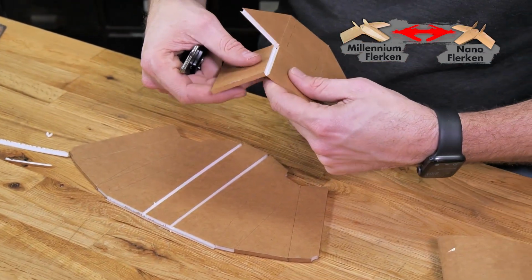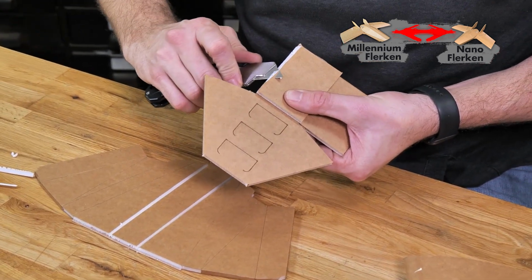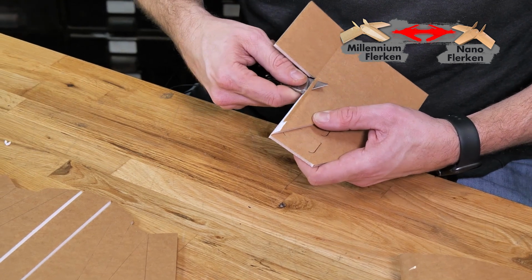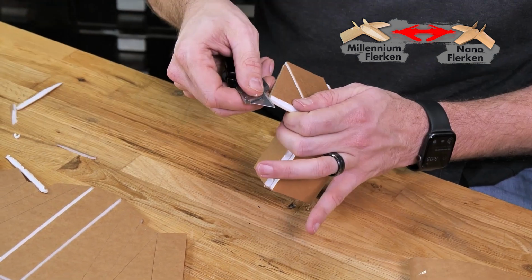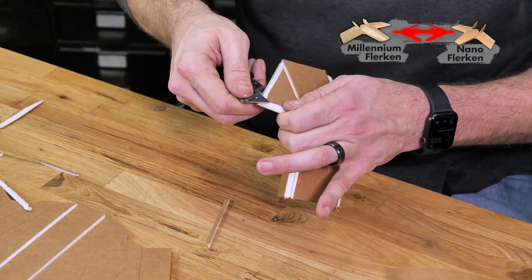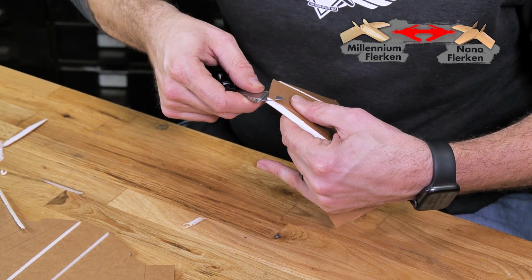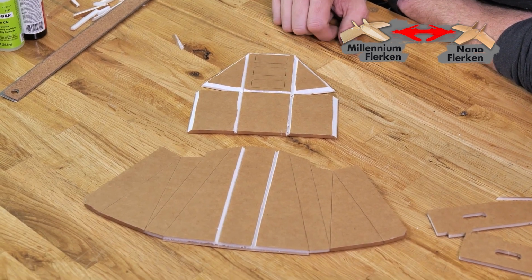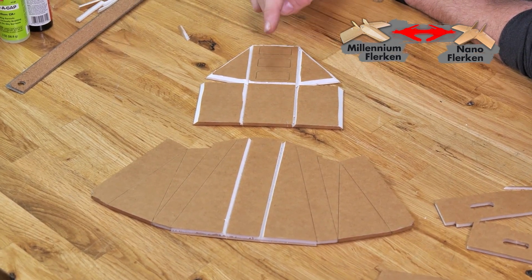And we'll do our single bevel cuts on our rear piece. And we'll continue these single bevel cuts all the way around this back perimeter. Now that we have all of our single bevels cut, feel free to pause your video and make sure that your pieces look just like what you see here. You're gonna see that the single bevels on the front nose favor towards the outside. And then also on the rear section, we have the same thing.